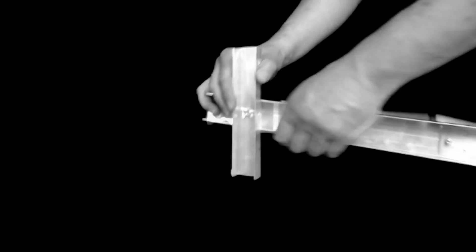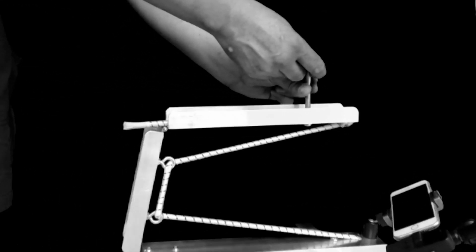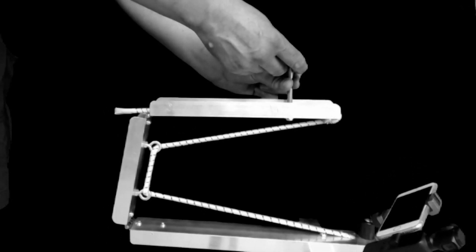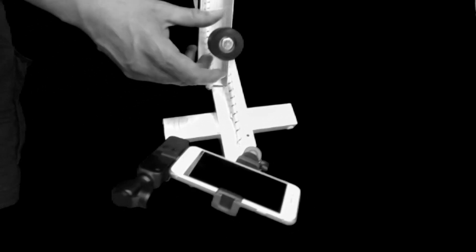The damping of the Osmo Pocket for left/right rotations is good, but I got very often shaky results when I had to make left or right turns. I decided to install an additional rotational disc with a rigid metal pin connection as a grip. This was indeed effective and now I obtain much smoother left and right turns.